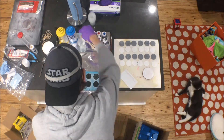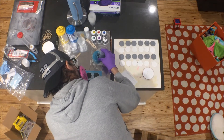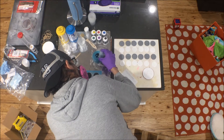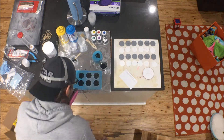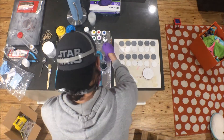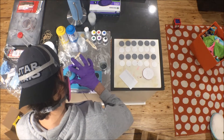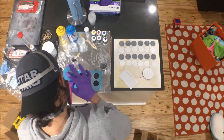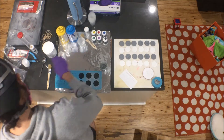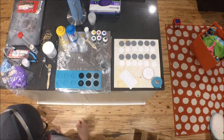A little bit of tapping on the mold to kick out any air bubbles. I still had some more left, so I grabbed a mold I had laying around — my junk mold for the rebel jewelry I'm working on — poured some in there, and tapped it to get the air bubbles out of the rebel symbol too. It didn't quite fill everything and it was starting to kick, but since it's just a test I smeared it around with my fingers. With that done, I took off my gloves and cleaned up.